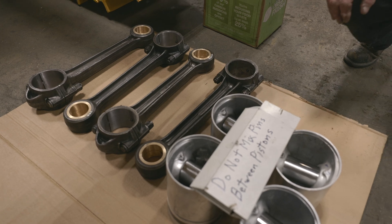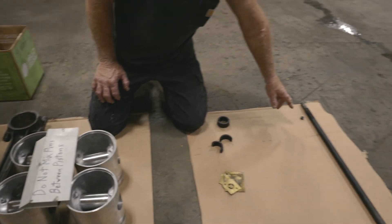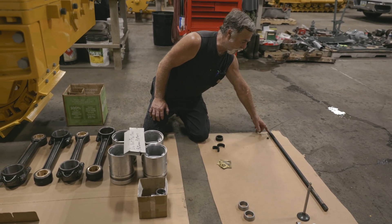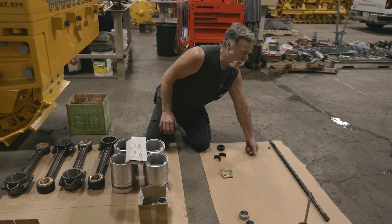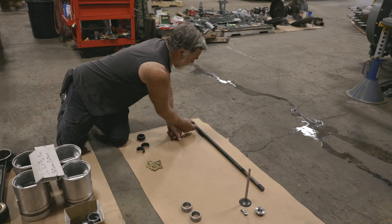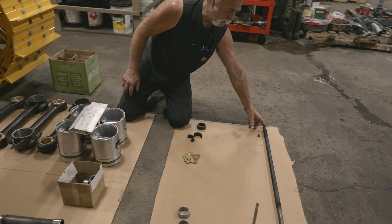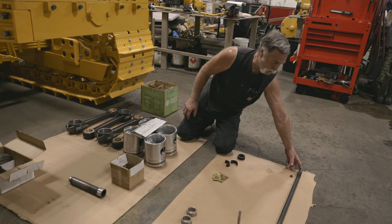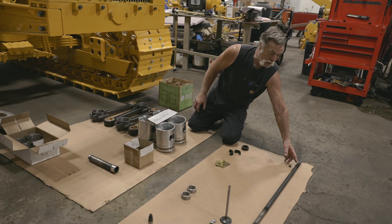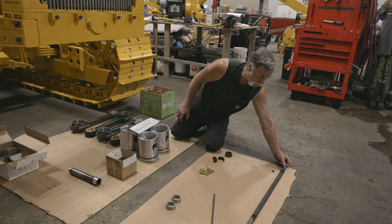We had a situation with the block where the deck had to be done. Our head bolts run through from the main bearing cap all the way to the top, and to get them all out we had to take a nut off up top. There's a little peg which locks it in on a slot — you thread it all the way off the top — but the main bearing bolts were over-torqued at one time and twisted the thread. So we ended up cutting them off and having all new main bearing bolts made.